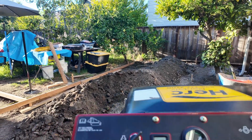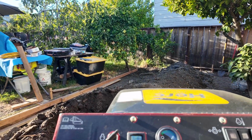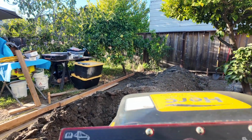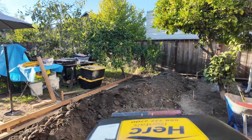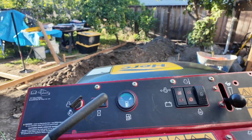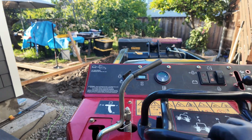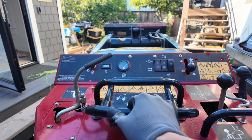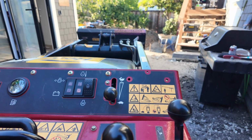And of course with this, because it's not a completely flat pad, you have to think about the elevations and the slopes and make sure that you're cutting away enough to allow for that gravel, but also to allow for enough concrete. So ideally I was looking for at least 4 inches of concrete throughout this driveway. Actually at the apron, it's going to be a bit deeper than that because that's part of the area that takes quite a lot of the force when you drive a car or potentially a truck up that. So I've got another load of dirt here, just bringing that back.